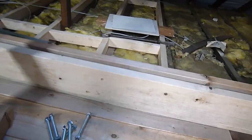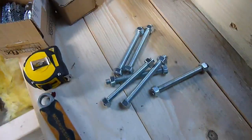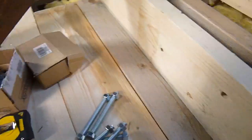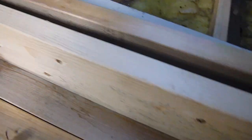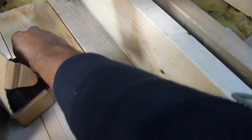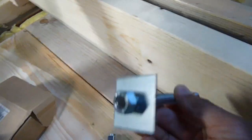I hope you enjoyed that little tip. Here are the two joists now up in the attic space - I'm just going to get ready to join them up. So we've got them laid out there. There are the nuts and bolts. I just grab one of these, take one of the nuts off one end. I did some pen marks there just to help me line it up. Then we've also got to put one of these square washers on one end of the thread, like so.